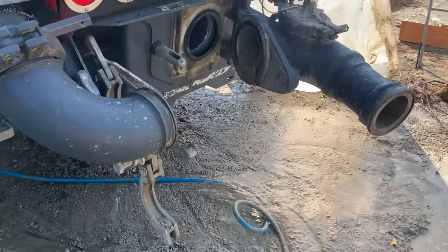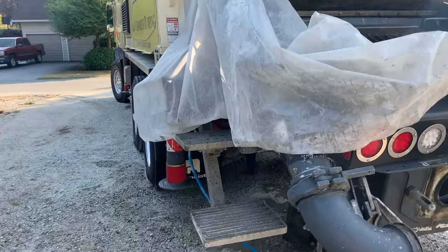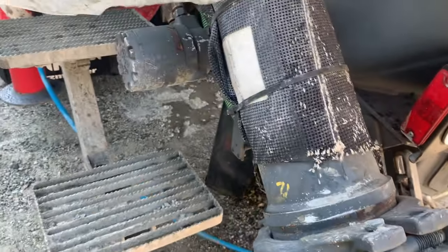Anyhow, one other thing I do here, super, super critical, especially using that round ball sponge, only a 5-inch round sponge. Once it hits this elbow here and you get into your 5-inch to 6-inch reducer, by the time that sponge is coming back down here, it's not tight against the walls of that reducer, so you end up with a lot of cream and whatnot in that reducer.